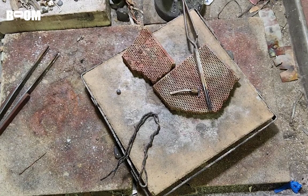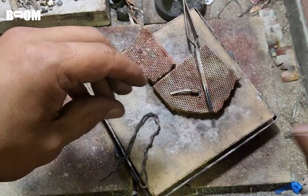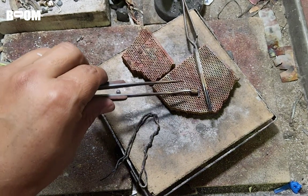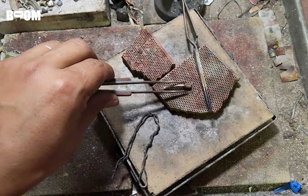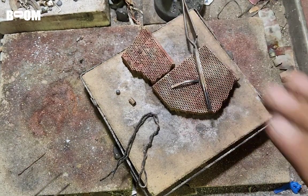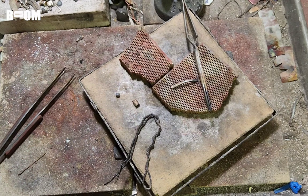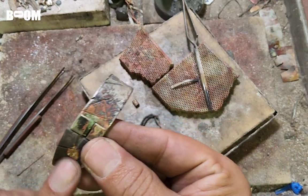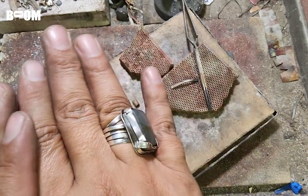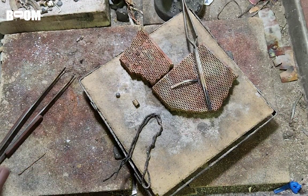All right, friends. I had a slight design flaw, and I wish I would have showed you, but once this was in there, it was kind of wiggling back and forth, and it was kind of hard to get it all lined up because I wanted to go left and right. So I decided that what I'm going to do is take this off, shape the back end of this piece more rectangular, and then make the tube also rectangular, but not so rectangular that it doesn't go into the groove up here. So I'm just making it rectangular on the end of it, and then hopefully that rectangle will hold it in a place where it maintains its orientation.